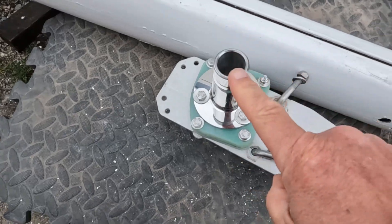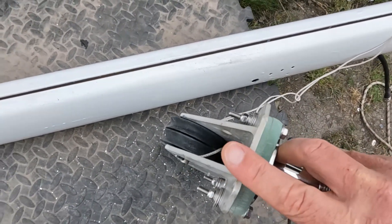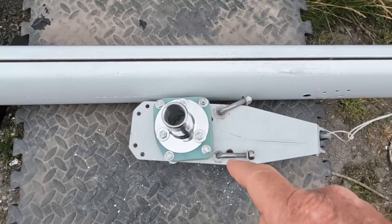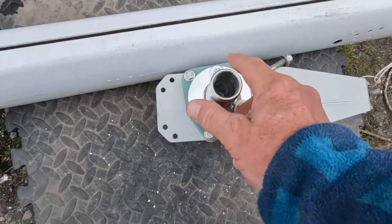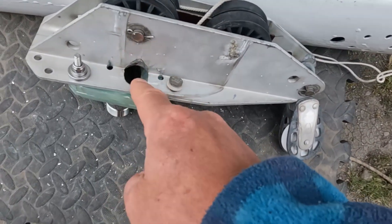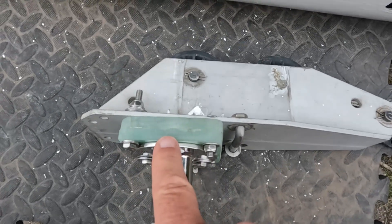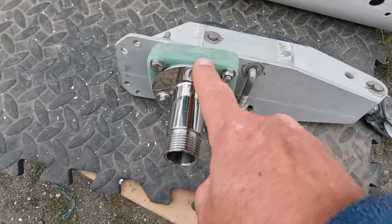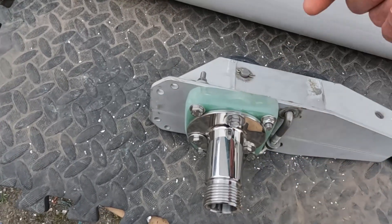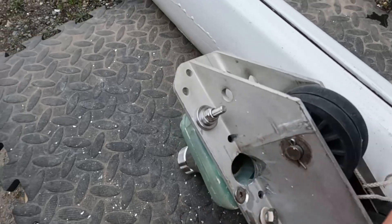When you look at this mounting it has three bolt holes and I had hoped that they would straddle the outside of these two supports, but in fact they were just a few millimeters too tight so the bolts wouldn't fit all the way through. I also had a huge problem getting the hole through here that the cable would go through — you can see there made this hole in the bottom — but I couldn't get the two to line up properly. So my solution has been to add these two layers of FR4, bolted together and then both layers bolted to the mast head, and between them they provide the angle so that the end of the cable can go through there and into the socket.